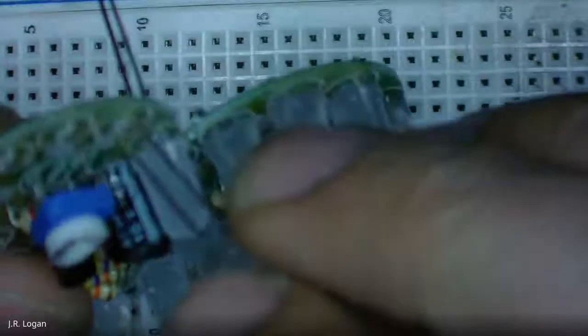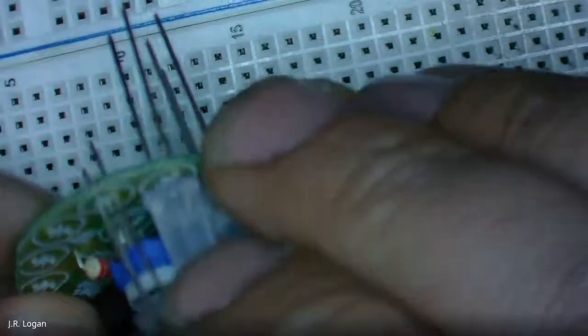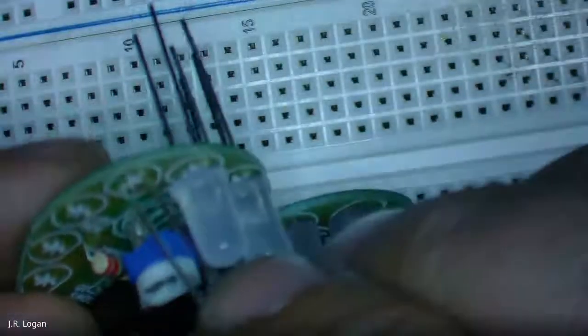Nice. Inspection is important. It is typical to have problems. And I had mentioned that the multimeter is nice to have, but not a need to have. If you find that things aren't working, knowing what component you have, you can check the conductivity between two pins to make sure that the solder joint is working. That's an advantage. It's great for troubleshooting when something doesn't work.